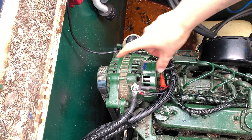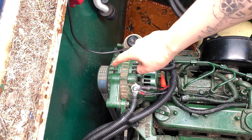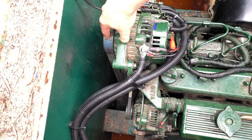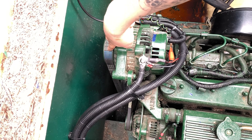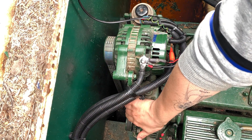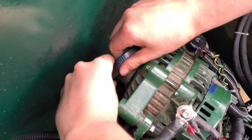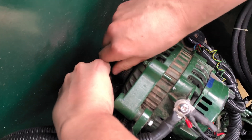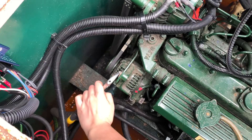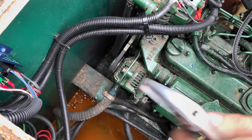As you can see, on an engine like this getting to anything around there is pretty difficult. There are two things: there is a nut that you have to loosen that will allow you to loosen the main belt, and then there's a separate one that you can loosen to get to the smaller of the two. Loosen the nut on the big alternator until it's loose enough for you to push it down and loosen the belt. Once the big one's off, loosen the nut on the smaller alternator and then take the starter belt off.